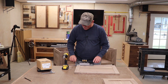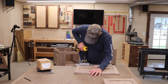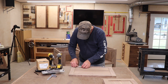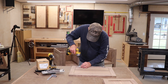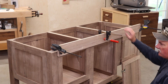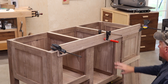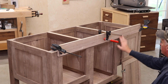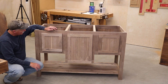I've set up for my euro hinges — got my hinge jig all set up and ready to go, just drilling for these hinges. I've clamped a straight edge up here, marked the locations, and I'm going to pilot drill and then get these mounted flush and tight. Then I'll adjust the hinges using their built-in adjustments to align that strip evenly.